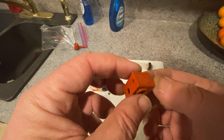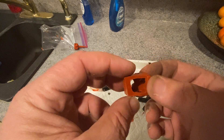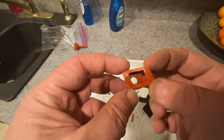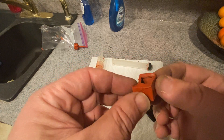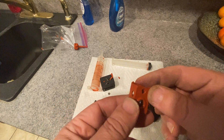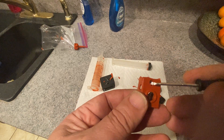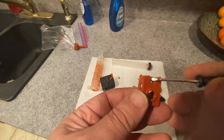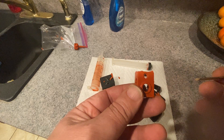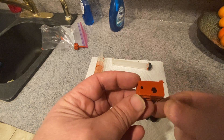Thank you so much Stefan. I recommend everyone go look at CNC Kitchen's original video — I'll try to put a link in. Take a look at how this mold was designed. It's a perfect mold for the E3D V6. The way I use this: there's another video where you can find the tool I make for holding it. The screw for the heater element goes in this hole — I normally put a regular cylindrical-head Allen screw there, not a button head. I have a tool that goes in here to grab the nozzle and counter-hold.